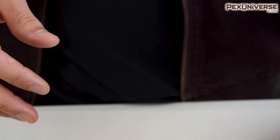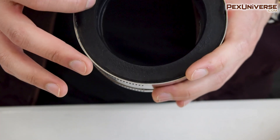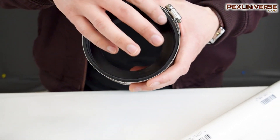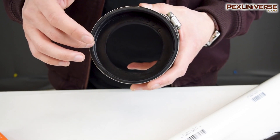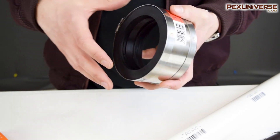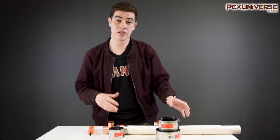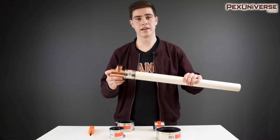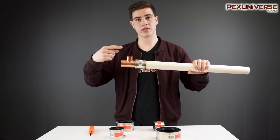It works for all sizes — if you understand it for one, you understand it for all. This side is thicker, this side is thinner. That's to make up for either the cast iron to PVC or the PVC to copper, however your plumbing situation is set up. Other than that, it is still just a coupling, so you want to make sure that you're connecting them tightly and that there's no warping going on.